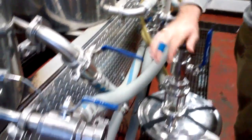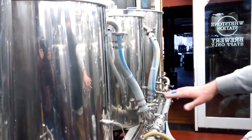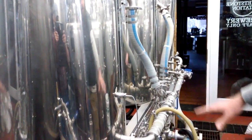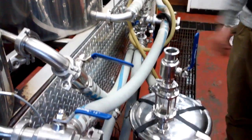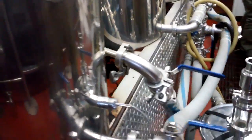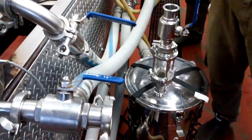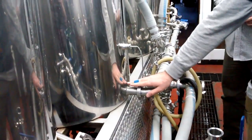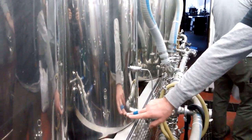And then this thing is in place of, before our pump, in our recirculation line. So this will gravity feed from the mash tuns, and the pump will draw off this rather than off the bottom of the mash tuns. Does the bottom of the mash tuns have malt and stuff at the bottom which you don't want, so this takes some of the clear stuff off? Mm-hmm. We could actually get you up there and you can look inside, but the bottom of the mash tuns have what are called false bottoms. So there's a screen that runs right above this bottom port here.